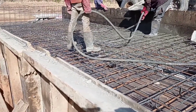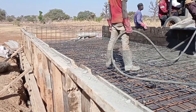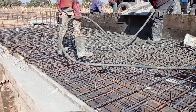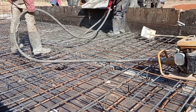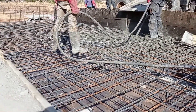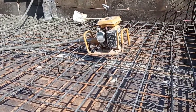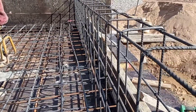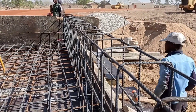The concrete is being mixed properly with the help of the concrete vibrator. As mentioned in my previous videos, it is a very good machine which helps us to avoid honeycombing. The reinforcement bars had a spacing of 250 mm, and at some places a spacing of 200 millimeters.